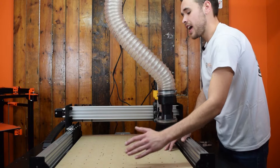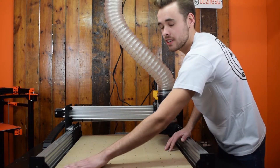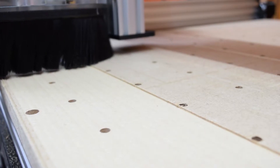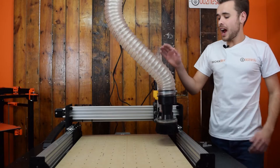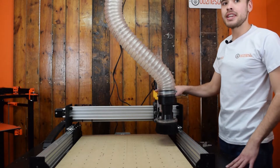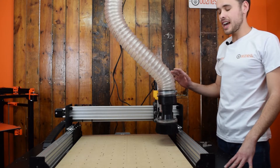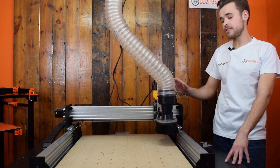We'll work across the board. If, for instance, we get over here and it hasn't cut into the board, we'll start again going down another one millimeter — so two millimeters in total — and do it again, and so forth. We're going to do 80% stepover at 800 millimeters per minute, around 20,000 RPM on the DeWalt — that's setting 2.5 roughly.